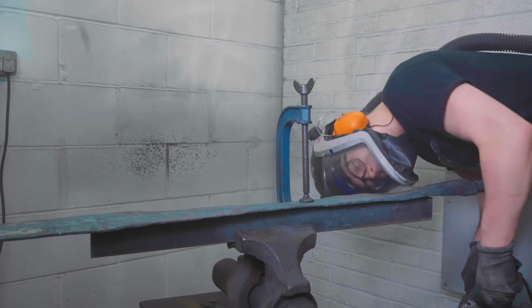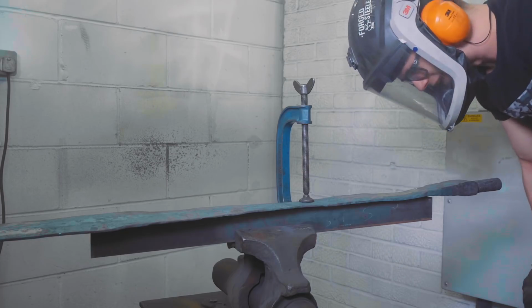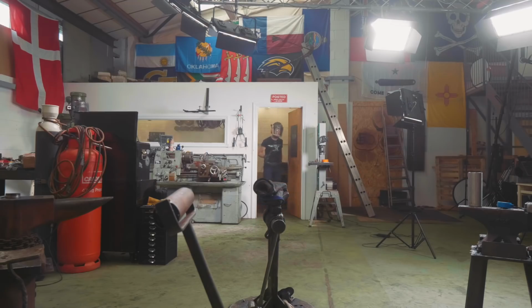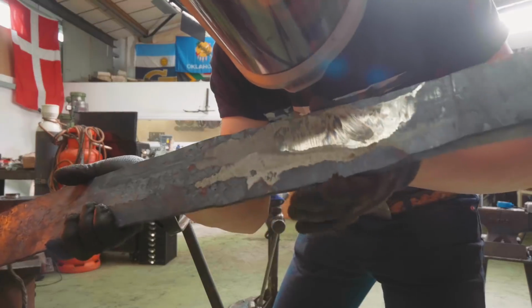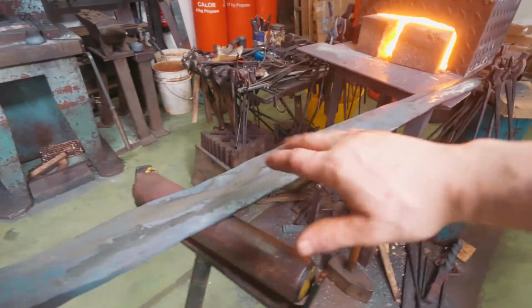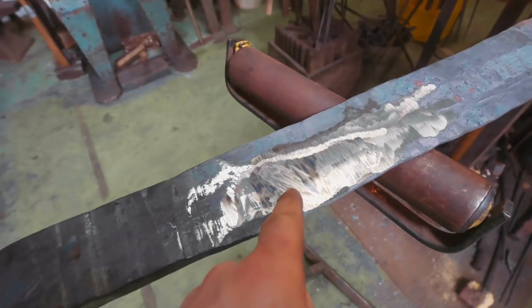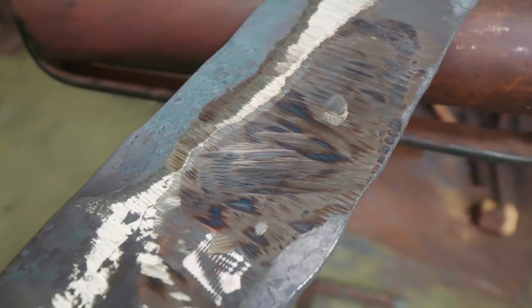Oh boy, this isn't good. We've not got a lot of thickness left there. Gee whiz, this isn't good. Okay, so I'm about 4 inches short of where I need to be, assuming that I draw the tang out right about where I thinned it down. So this blade right here is a pretty good length as it is, but I've now thinned it out a massive amount, grinding away the crack to see if we can grind past it, and I've not ground past it, as you can see.